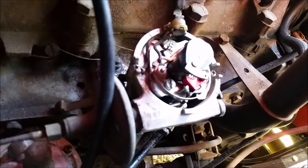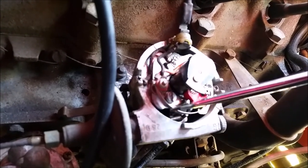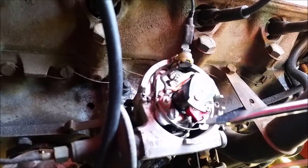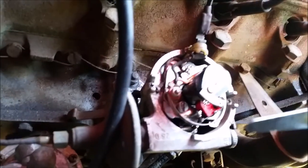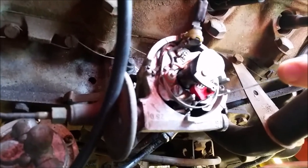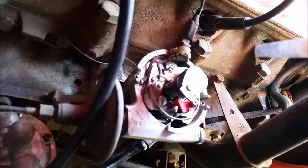Here you can see there's a little tiny contact right there, and that's driven by this spring that looks like it's out of a watch. In between those two contacts, they're supposed to be between 14 and 16 thousandths of an inch. So what I did is I got my 14 thousandths of an inch feeler gauge and slipped it in there and tightened it up until I could just barely slide it in and out. Between backlash and manufacturer tolerances, by the time I can actually slide it back out again it should be about 15 or 15 and a half thou.